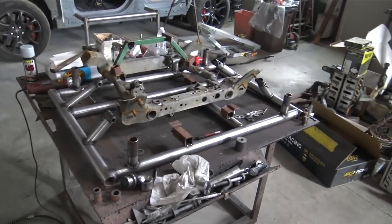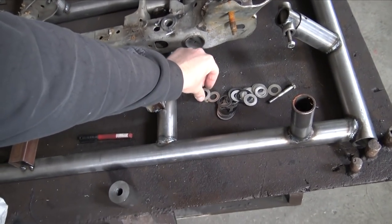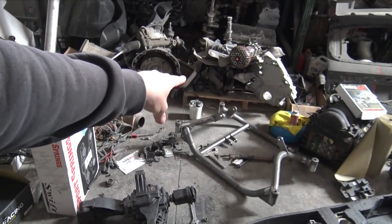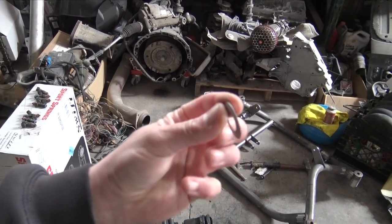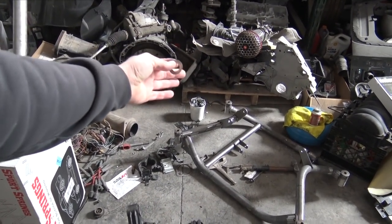So what I'm gonna do now is there was a few things that I didn't have really thin washers. So I used some larger washers on all these tabs. What I'm gonna do is cut the tacks on them, use these really thin, I think they're probably like 1 mil washers, and reposition those tabs, re-tack them in. We'll get this subframe back in the fixture.